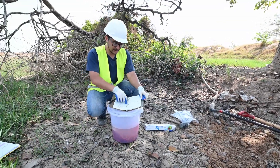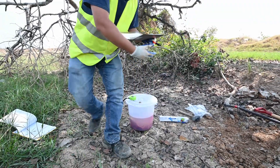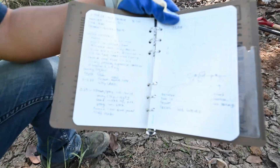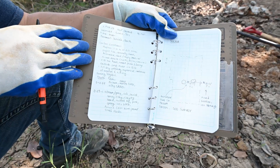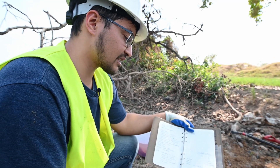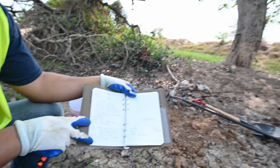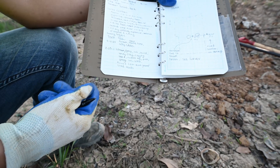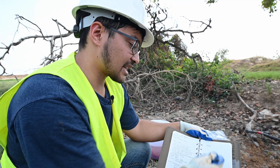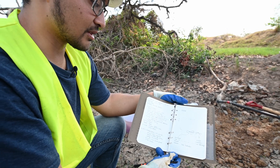You'll need a notebook as well, and a tape measure to measure the depth that you retrieve your samples and the depth of the borehole. In my notebook I like to take pretty thorough notes. I've documented the weather, the time, the personnel, and who's doing the augering. Generally when I go to a site I always make a note of the surface conditions — are there any unusual things such as erosion on the surface, or even tension cracks that you might observe. Note all these things down. Maybe there's fill, as there is on this project site, so you'll want to document that all before you even start your boring. Below I have the boring log, which is just a description of the soil relative to its depth. Here we saw that there is about 0.25 meters of silty sand over some stiffer clays. And the last thing to include is a sketch of your borehole location relative to the rest of the project site.